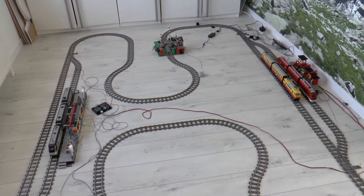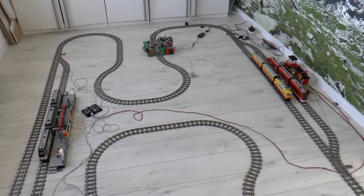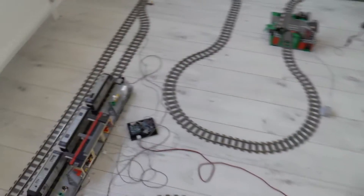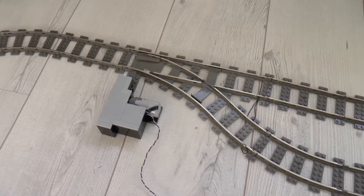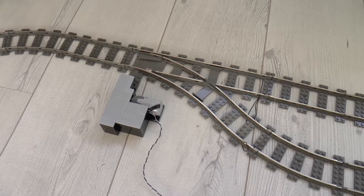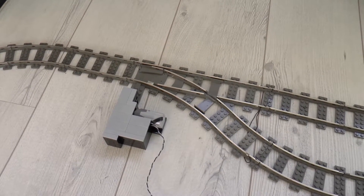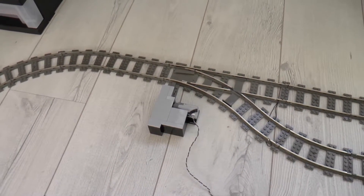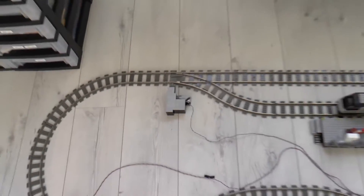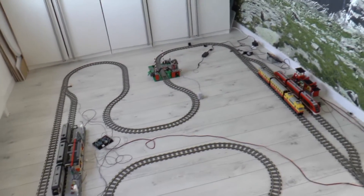The idea, the functional design, comes from a friend of mine, Hilko. Instead of one big controller, we now have several controllers. Every station has its own controller, its own sensor to detect trains, and also its own switch point. The switch point is also new — the previous design was about 600 milliseconds and this one is 200 milliseconds, so I'm now able to switch the tracks very fast, and with fast responses come also less time needed between trains.